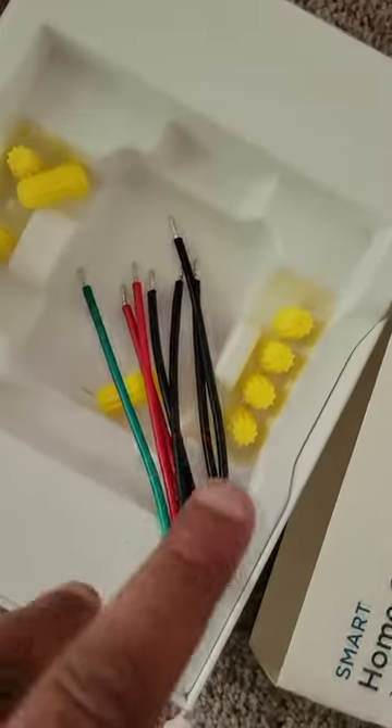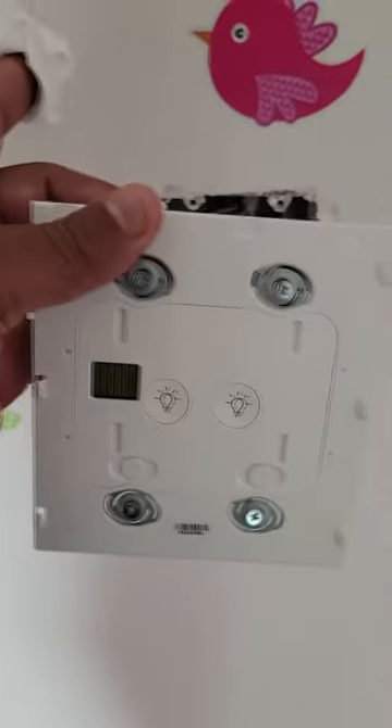What I did was take a wire — Brilliant actually gives you a bunch of different color wires. I took one of the white ones, added it to the neutral wire that was already in this outlet box, and just put it in. It's pretty easy. Now, before testing, it's important when you put these wires in that you don't cut the tip to the point where copper is exposed. If you see copper, that's wrong — you don't want copper to be exposed, as that'll cause a fire hazard. Make sure no copper is exposed.